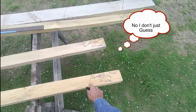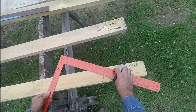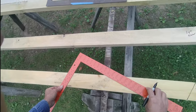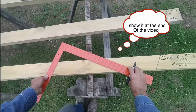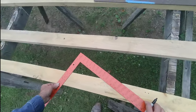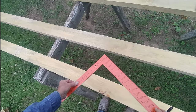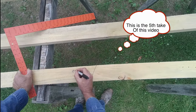How are we going to figure out how long it is? No problem. Put the 12 inch there, 6 inch there, mark it — that's 1 foot. We do it again — that's 2 feet. Again — that's 3 feet. Now, we said it was 4 foot to the center, so we do it one more time. That mark right there is the outside of the wall.